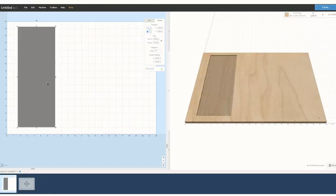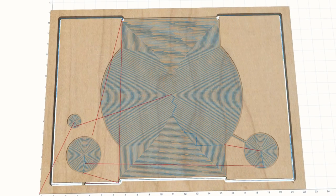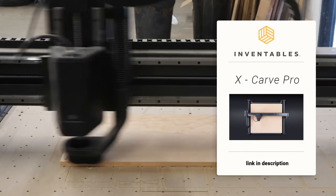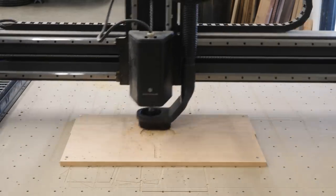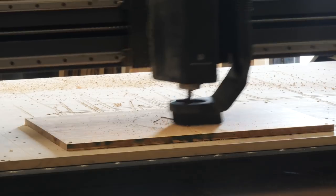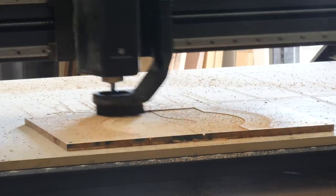Everything was modeled in SketchUp and then we popped it into Easel, which is the software the X-Carve runs off of. Within the world of digital fabrication, I'd say these two are on the user-friendly side when it comes to software. So with confidence high, we let it rip — and we immediately messed up. We started our cut too far away from the front edge, so we were just carving air along the back edge. User error. But thankfully every plank of wood has two faces, so we flipped it over, made sure we started the cut at the right spot, and this time we got it right.